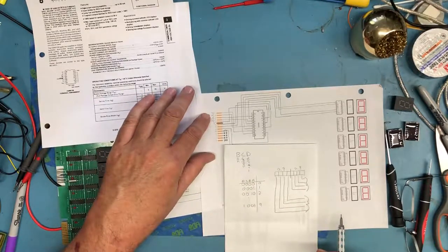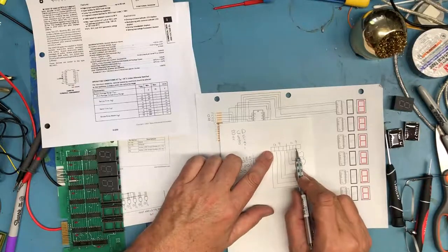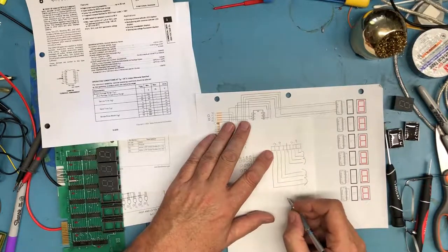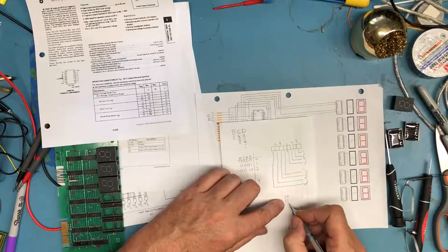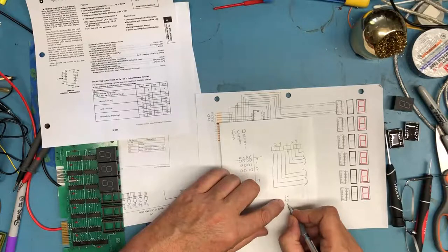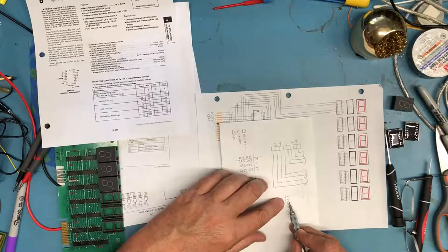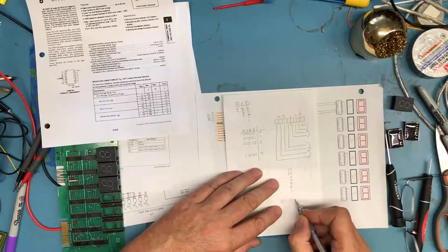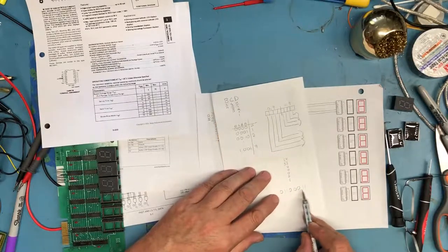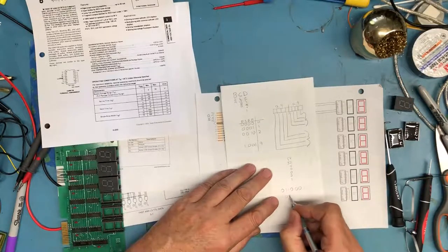In this case, we're only using four bits here, but if we were inputting more values in BCD, it's just easier than taking 99 in binary. Can I do it in my head here? 64, 32, that's 96, 16, 8, 4, 2, 1. So in binary, 99 is 0110 0011, I believe. Whereas in BCD, to represent that 99, we have 1001, 1001.